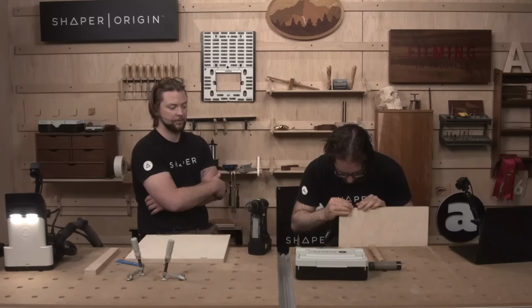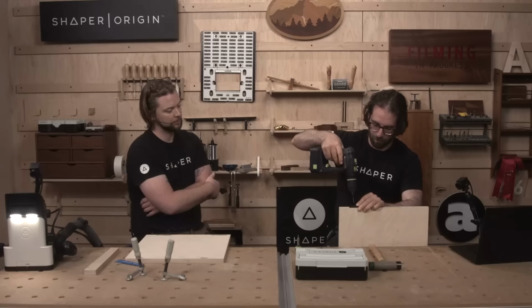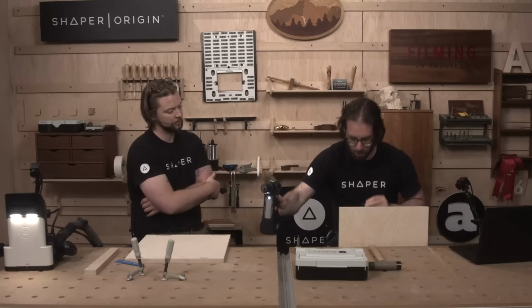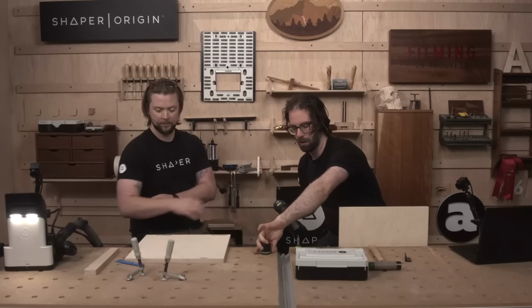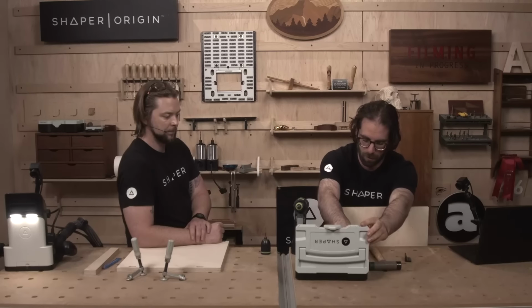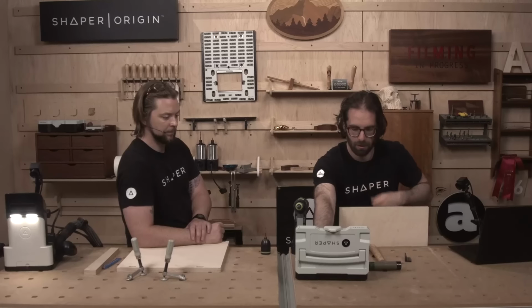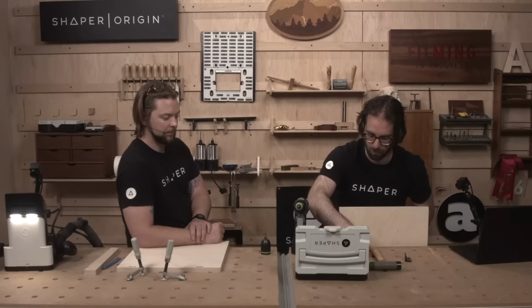The first cut is probably going to be a little bit tight, but once you get there, this drill jig is going to be perfectly lined up with the bit that you have. Nice. That's 2. Now we can just swap out here on this side for the Torx, and on this side, since I just did 1 pilot hole, I'm going to use 2 single connectors, and I'll go ahead and use just the middle of the road 20 millimeter screws.